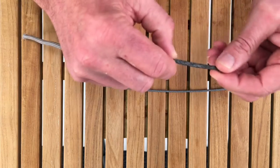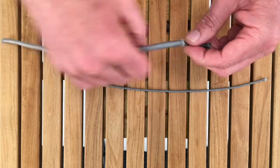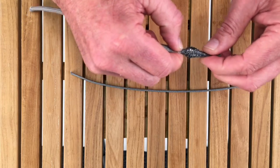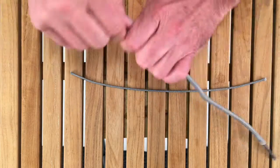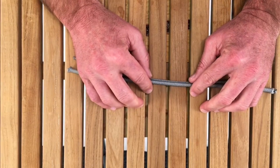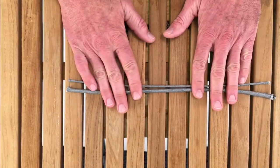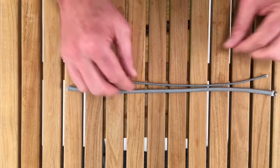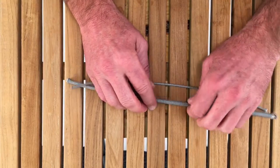It is a coated core, so the jacket can be pulled back, buried, and it's a medium braid. This can be used for replacement lifelines and some select standing rigging applications — backstays, things of that nature. But the vast majority of what we see are used for replacing wire lifelines.